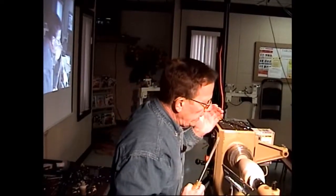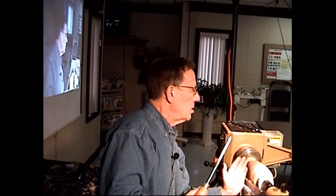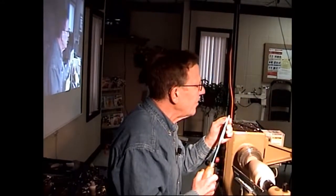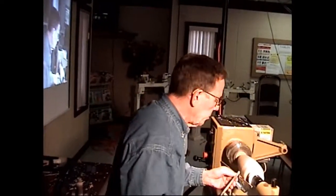And I like to liken that to having the cutting edge at a 45-degree angle to the axis of the lathe. If you get that cutting edge at about that 45-degree and then you twist the gouge until you just feel that cut getting sweet, you can feel it and you can hear it in most cases. And that's what you're looking for here.